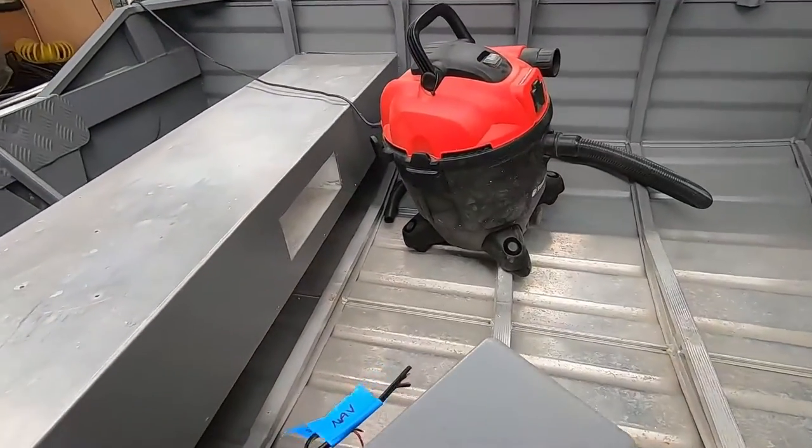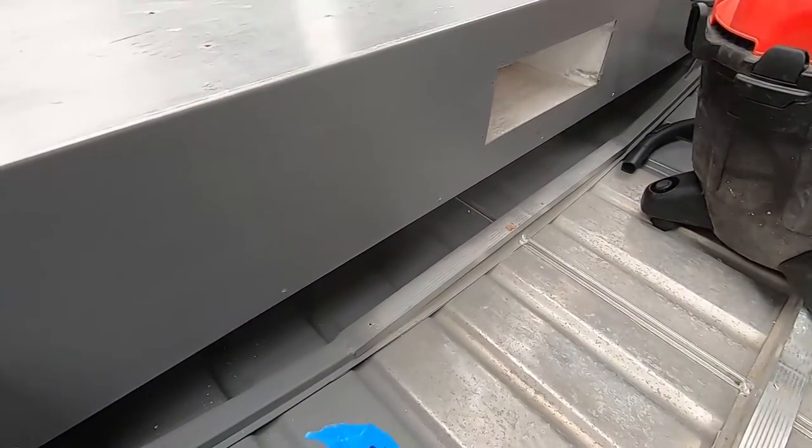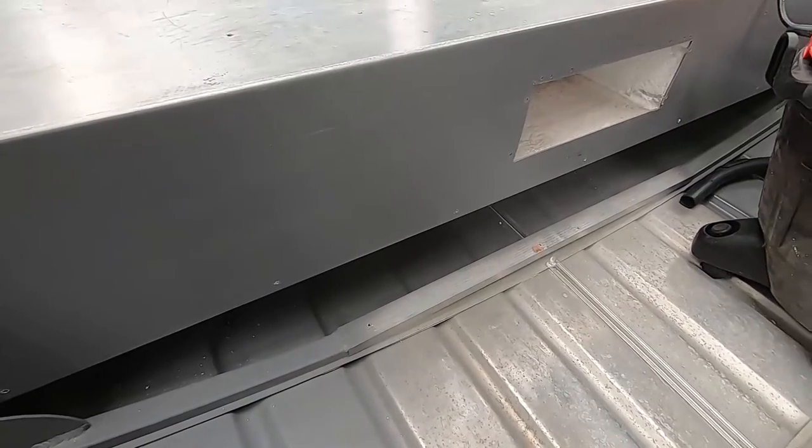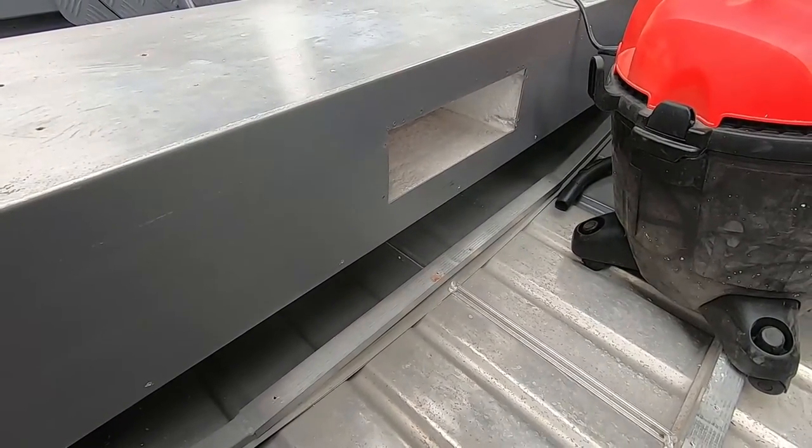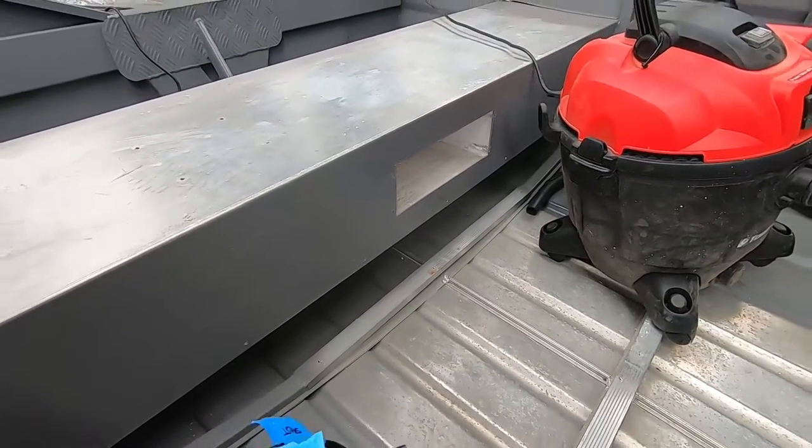And also in the center here, I've drilled that hole where that courtesy light's going to go for the back. So I've also got to tap into that, and we'll run the cable around the front of the seat, and it'll be hidden with that front kickboard basically. It'll run under there, and we can tap off into that and join it under the glove box, that courtesy light. So that's the next job.